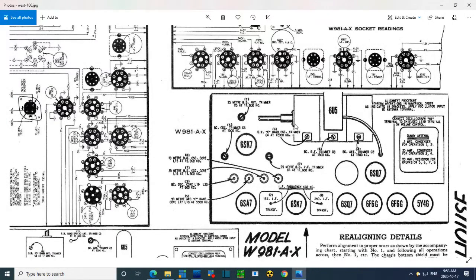Okay, looking at some of the information for this radio, this is the 31 meter band oscillator adjustment right here. But look, this is the one that does another band, the C band, and then you further do the C band up here like a sub-trimmer. But this is what's so weird. This sub-trimmer is right on the main tuning capacitor. You got me how this is supposed to work exactly. Maybe this is all the confusion here. So adjusting this one is affecting this band too. And that might be affecting even more in the radio. I'm not sure about that. So getting this right is really, really critical.